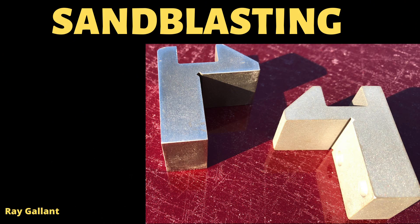Sandblasting. I know you're not supposed to sandblast — you're supposed to use glass medium, but I didn't have any. By using sand instead of glass, there is a possibility that you could have altered the size, dimension, and finish of the actual part.